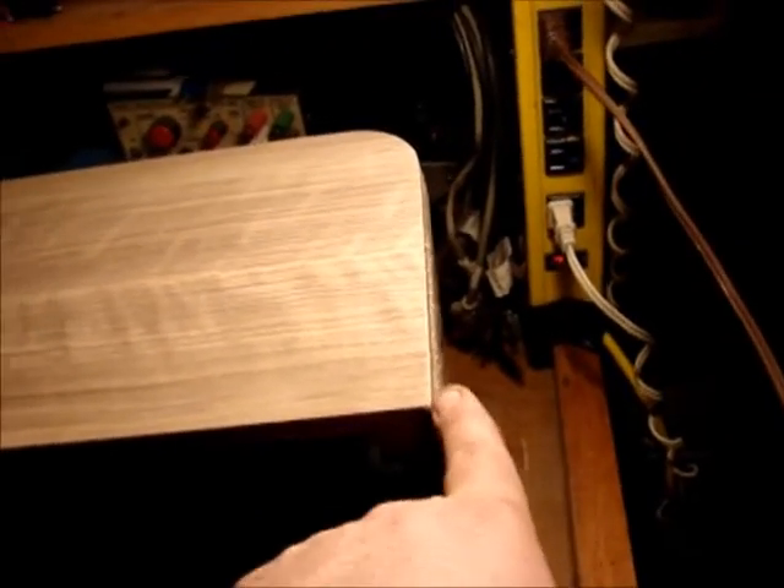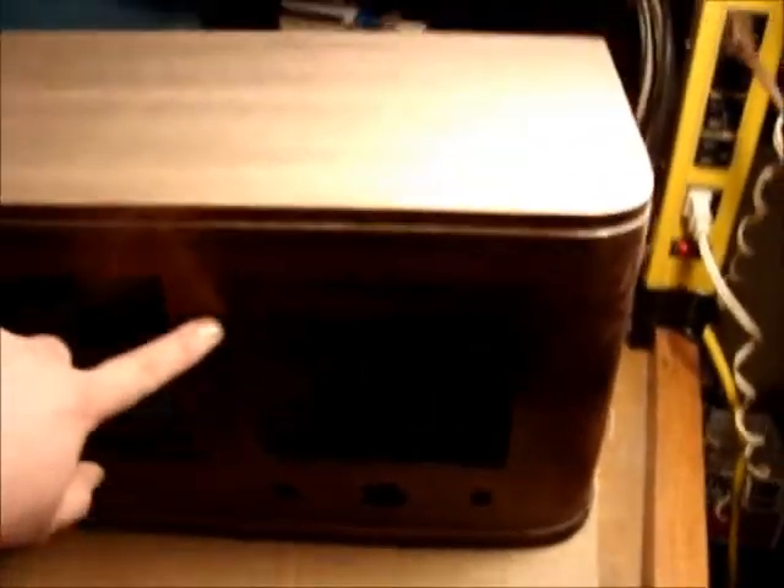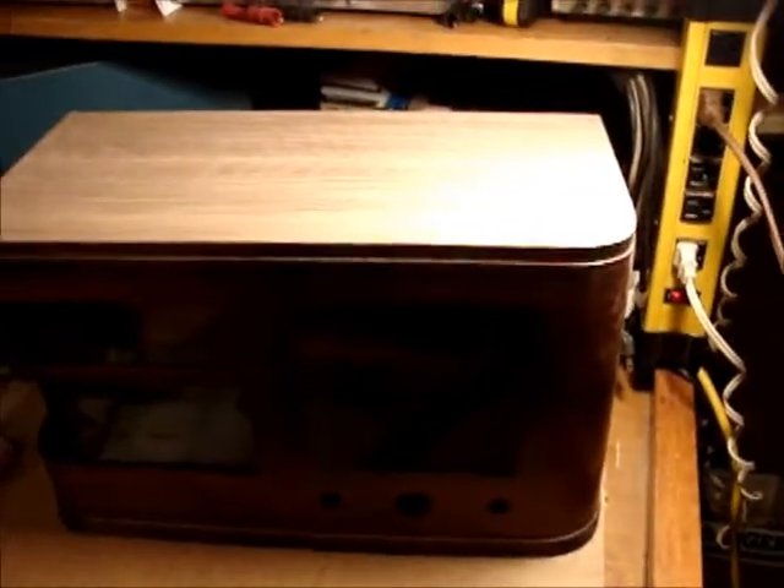I probably won't tackle this little piece either — I'll do that when I do the front. But it doesn't look bad; it's nice and smooth and I don't feel any imperfections or divots underneath the veneer. If I can match the color, which will be a little tricky, I'll give it my best shot. I've got some lacquer and I'll clean up this edge because there's some gunk in there. Once I get this piece replaced I'll give the whole thing a real light sanding because I don't want to mess up the colors, then give it a couple coats of lacquer and see how it comes out.